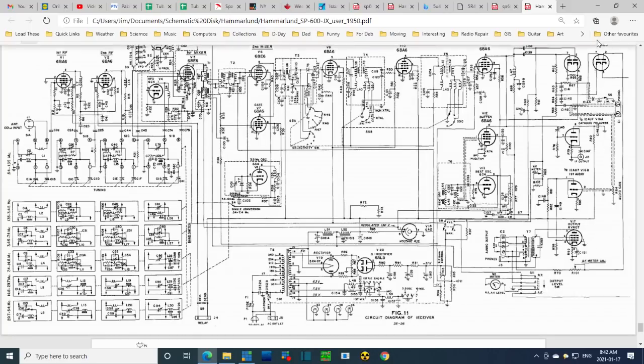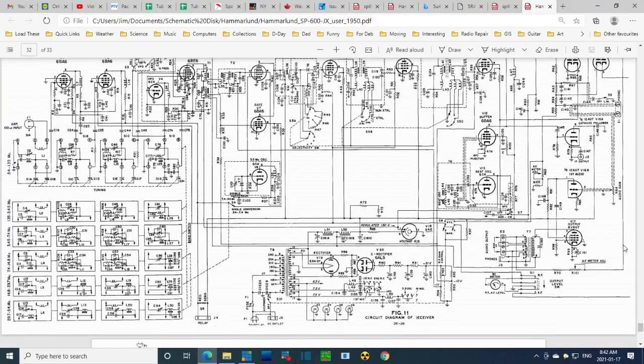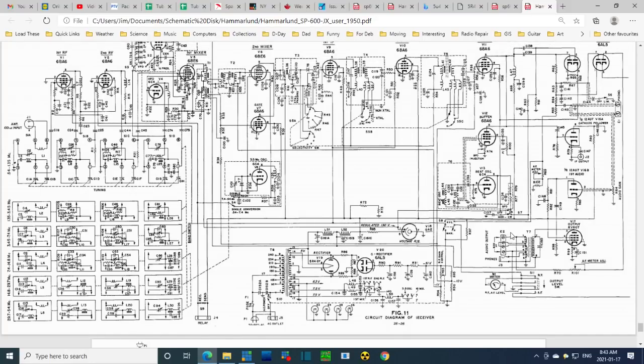So we're interested in this tube here, V15 and pin 7. And what we're asking is, no, pin 2. Looks like this tube is doing two entirely different jobs. It's a two-part tube. So we're looking at this part here, pin 2, we follow it. Going through the meter adjust, and R70, I don't know the value of that offhand, this could be set to zero, but this can't be set to zero, and then it comes in here, gets to the outside of the audio transformer, so the resistance measurement goes through all these windings, down here, come onto this wire.